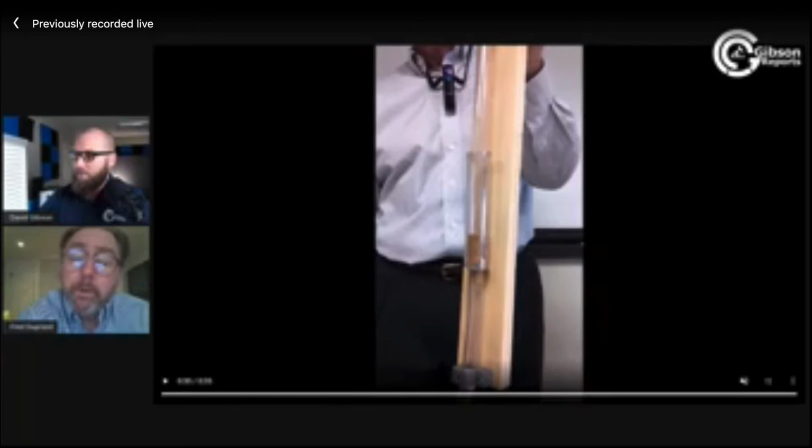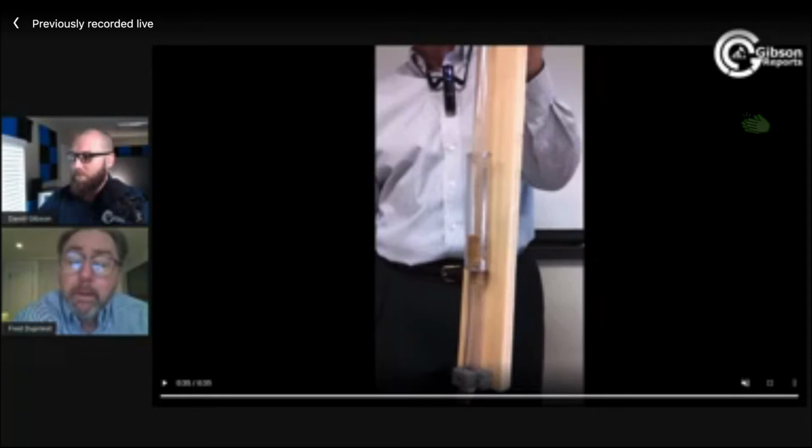You don't want your primary response to be to circulate longer before you come out of the hole, because you're not going to clean this enlargement out. The slip rate's greater than the flow rate. You could pump some sweeps and do some good, but you're burning rig time and you still don't know that you're getting this clean, especially if there are cavings that are somewhat larger. They're just tumbling around in here, and you may still find your bridge, and it's really costly to rerun casing.